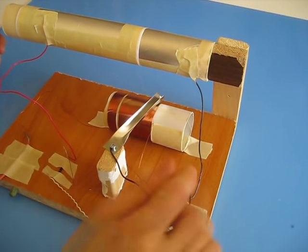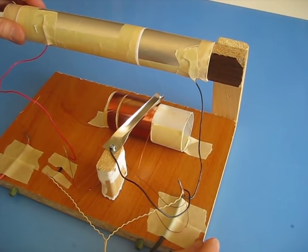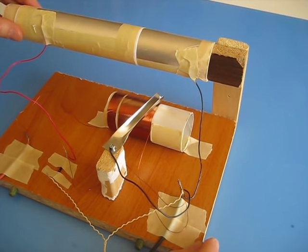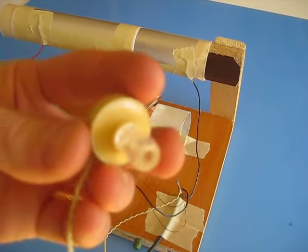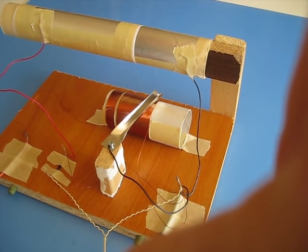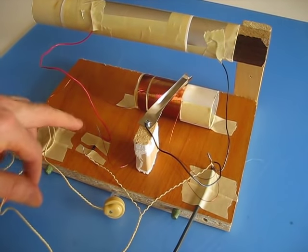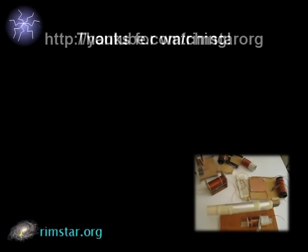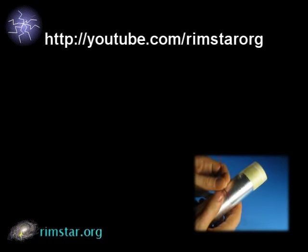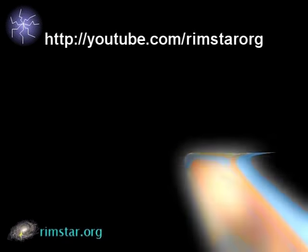To adjust it, you adjust the wiper first so you hear something. If you don't hear anything at all, just keep moving this back and forth, and then once you find something adjust the volume using the capacitor. There you have it — a crystal radio made mostly from junk, with the exception of the diode and the earpiece. Thanks for watching. Be sure and check out my YouTube channel, Rimstar Org, for more science and tech videos, including more crystal radio related ones. Also be sure to subscribe if you like these videos, or give a thumbs up or leave a comment or question below. See you soon!